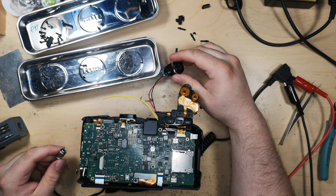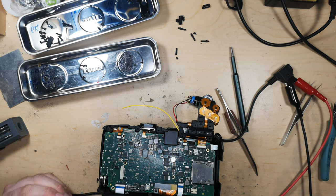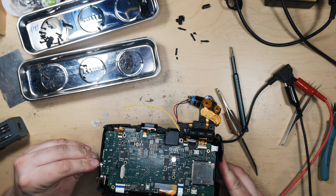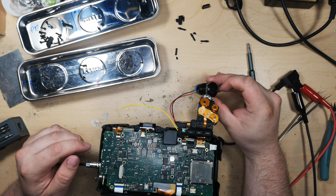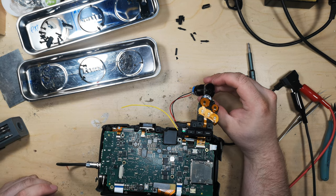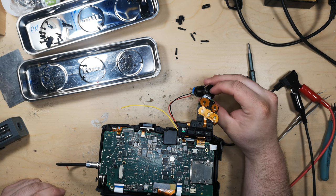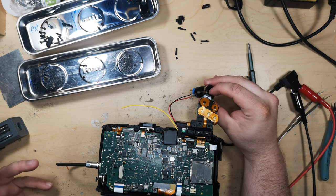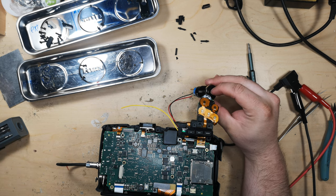I've wired up the red and black to a switch. So I've got my supply set to 12 volts, 2 amp current limited. A bit higher than I'd like, but I don't want to damage it from under amperage as well, which I hear is a thing. Oh shit, 1 amp draw, 1.2. Oh, the light's there. 1.2 amps of draw. Shit, I don't have an HDMI monitor, a tiny one. Okay. Yeah, 15 watts, 16 watts, which is right for idle from what I understand, 1.285 amps at 12.32 volts.